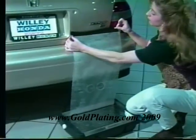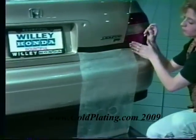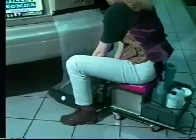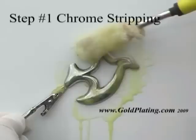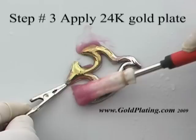Using the Gold Star, the chrome can be professionally replaced with hardened 24 karat gold. After meeting personal safety requirements and setting up the rinse water drain apron, there are three simple steps required to properly gold plate a chrome item. Notice that each handle is color coordinated and preset for its function to eliminate any possible confusion. The first step is removing the existing chrome. The second step is activating the underlying nickel plate. The third step is applying the durable layer of hardened 24 karat gold.